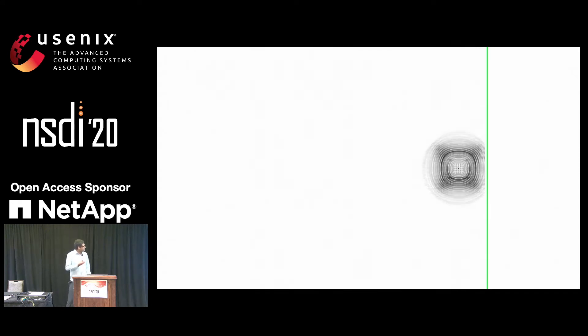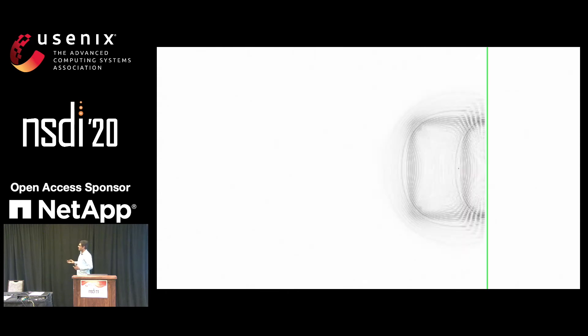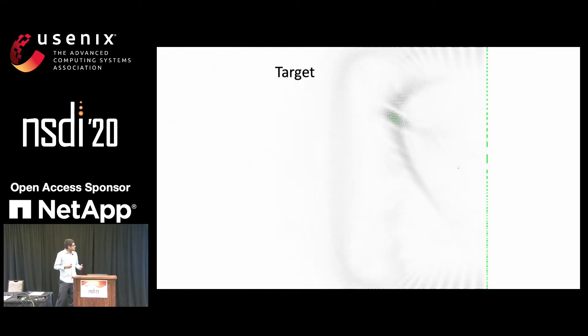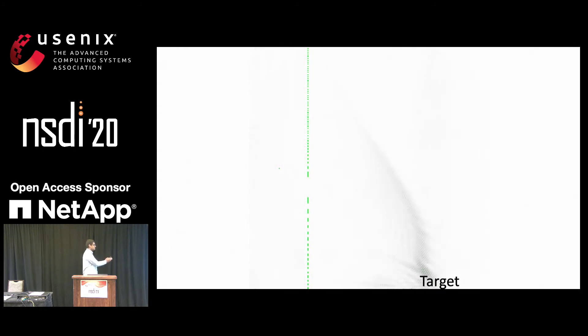To understand how this helps, let's look at a simulation. Here's the transmitter, and it is transmitting a pulse that gets reflected off of a wall. So far, this behaves as expected, like ripples in a pond. Now, if we put holes in strategic locations in the wall, we can actually make the signal focus at any point that we want. This is because we have eliminated destructive interference at the places where we put the holes. And the same holes in the other direction, where now it's acting as a lens that focuses on the target, where earlier it was acting as a mirror.